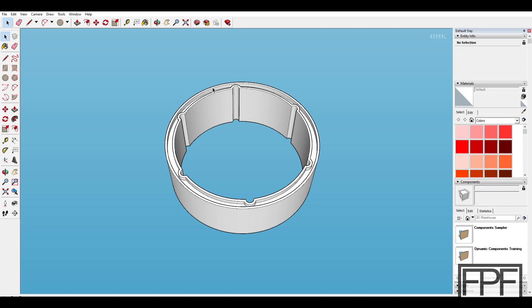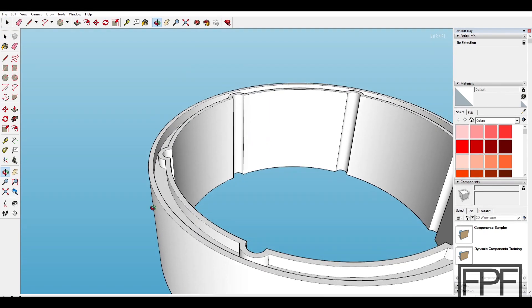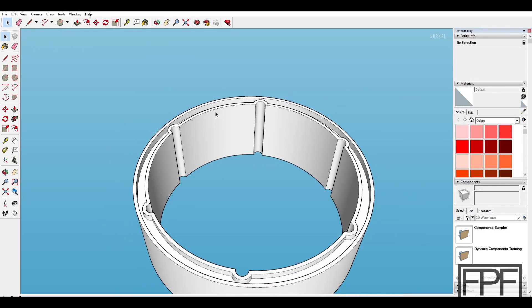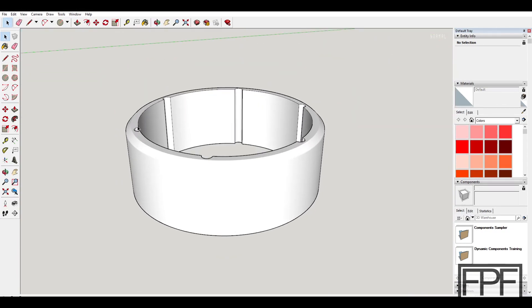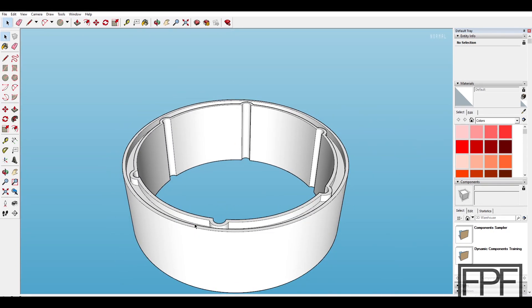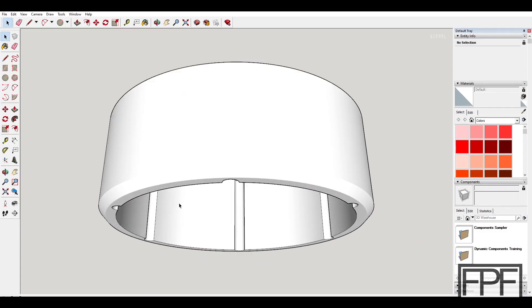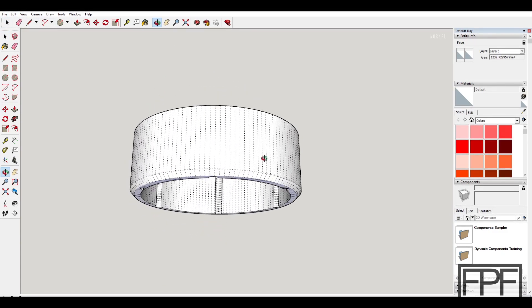On a smaller diameter, it probably is going to try and spring back a little bit, so you definitely want to make sure you clamp this into position. As you can see at the top, we have that nice deep groove that we fill with caulk, just to get extra adhesion inside there. These grooves on the inside were also added both to help this flex around the outside diameter of the pipe, and also give you more room for adhesive — whether it be caulk or shoe goo. The bottom with the relieved edge — that is the bottom, don't get confused, that's not the top. That's also why there are these cutouts that go all the way down through, so that any water trapped up here can drain through. So this is the top — you're going to want to print this edge against the bed. This is a bevel, not a rounded edge, so this should print without any supports, and TPU tends to stick really well, so even though the part is relatively large compared to the contact area with the print bed, I don't think this is going anywhere.